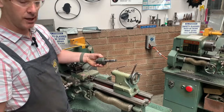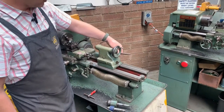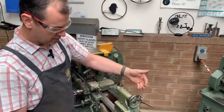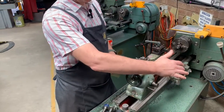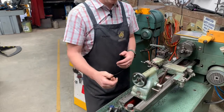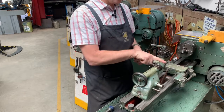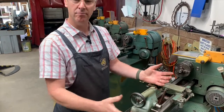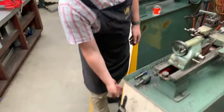To release the chuck, turn it backwards — it'll stop but still be protruding about a centimeter — then another couple of turns and out comes the chuck. To hold our tail stock onto our bed we have a locking lever at the back, designed to clamp underneath our bed. Lift up that lever and give it a tap — it locks onto the bed nice and secure. I find it very handy to lock the lever when putting drills in, tightening up the drill chuck, and taking accessories out, so it's not moving around — makes it a little bit safer.